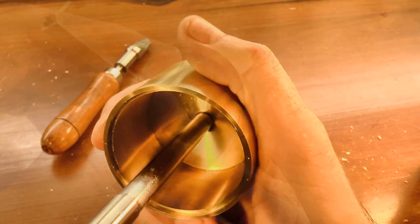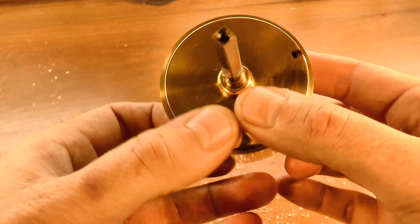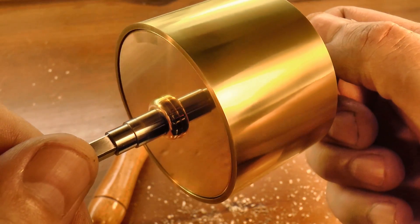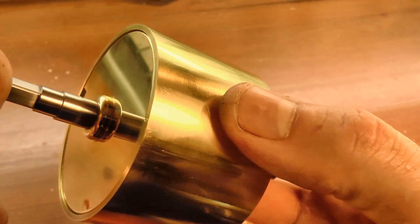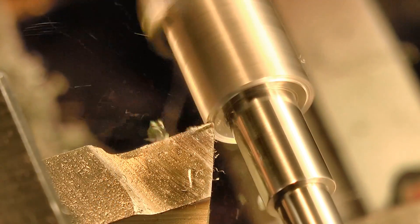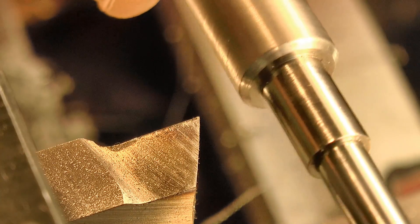Now by forming a tapered hole in the end caps, the bearing surface that's in contact with the arbor is made much shorter, so the friction acting against the barrel rotation is greatly reduced. The arbor has a nice amount of end play inside the barrel, so it's basically done. All it needs is a decent chamfer on the edges to reduce the surface contact with the caps. I'll do a similar thing with the pivot shoulders that contact the plates, when I let the arbor into the clock frame in a later video.